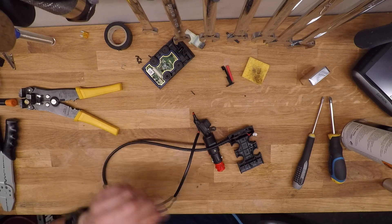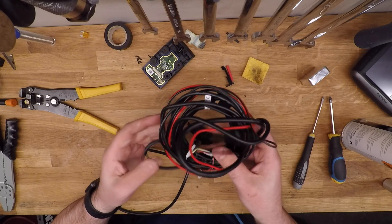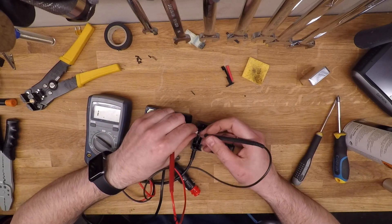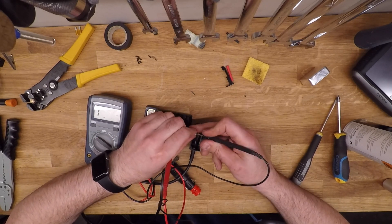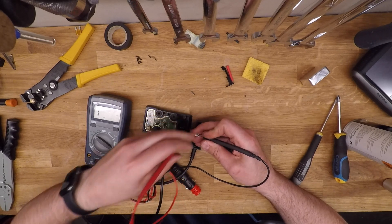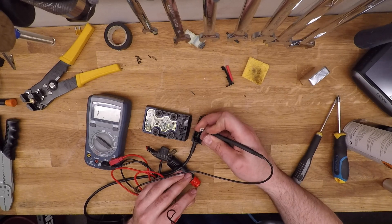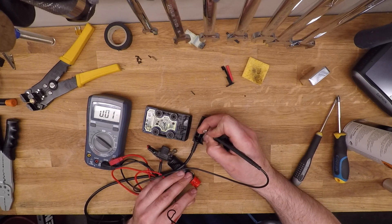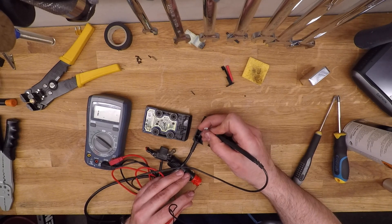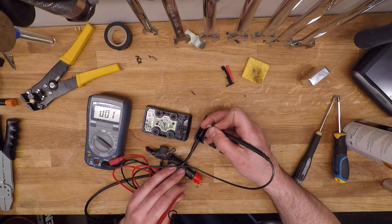So everything put together there. Let's now compare that to the original cable chaos from Garmin — it's obvious why we want to do this. So just to make sure before we hook everything up, we do a continuity check of the connector. Just check that we have connection on the positive — that's OK — and the negative, and there is no crossover to the positive. And that's OK.